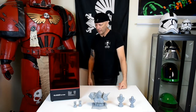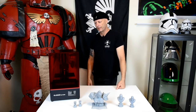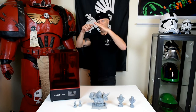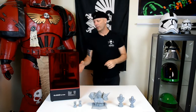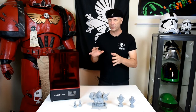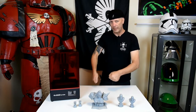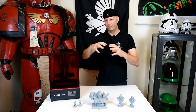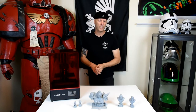The only issue I had with the Saturn was towards the last couple of parts I was printing. I noticed that on this base right here, parts weren't staying on the plate as far as supports go. What I think happened was when you're removing your prints from the build plate, if you're not careful when holding on to it and scraping the parts off, you could easily contort or knock it out of leveling alignment. All I did was re-level and that solved the problem right away. Keep that in mind when you're removing parts from the plate.